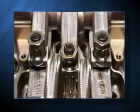On engines equipped with EUI electronic unit injectors, with the lock nut on the injector rocker arm adjusting screw loose, turn the adjusting screw down or clockwise until the screw and injector bottoms. Next, back off the injector screw counter-clockwise one and one-half turns. While holding the adjusting screw in position, tighten the adjusting screw lock nut.